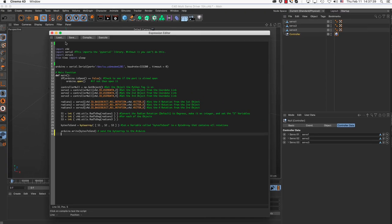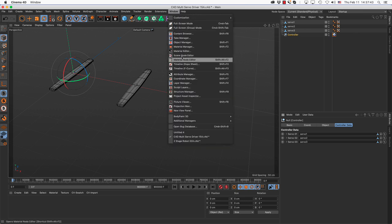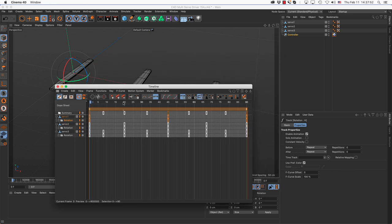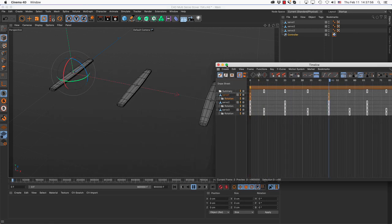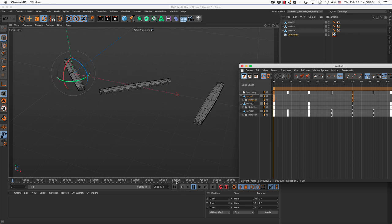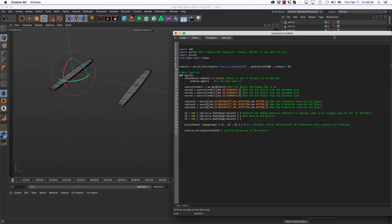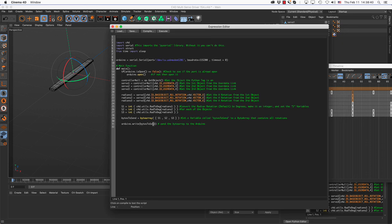In the timeline, all I've done is create rotation keyframes on the H channel for three objects, at different rates so they move at different speeds — one faster, one slower, one very slow. One thing to know about the servos themselves: there is a limited range of motion. The serial protocol allows you to send values from zero to 255, because binary integers are 8 bits.